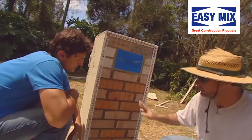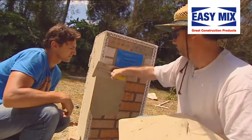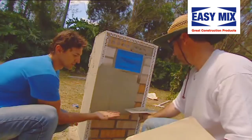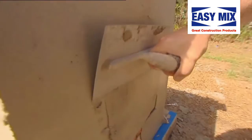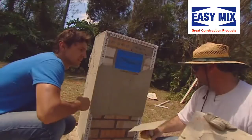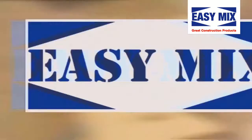Once the water's gone and the shine's gone off the wall, then it's ready to render. You can do that process on a small area with a brush — just any old household brush or broom. If you've got a bigger area, you could use a hose and give it a light spray. Starting off almost parallel to the slab and then slowly giving it angle — to the top so you can get that even pressure down. Start with your trowel slightly accentuated and then gently ease the render off the trowel by changing the angle as you're going up the wall. The corner bead is exactly for keeping it level — push your trowel with a nice bit of pressure on the bead, and that guarantees it's nice and flat.